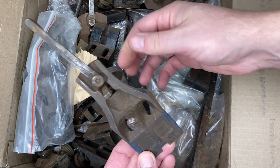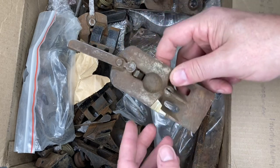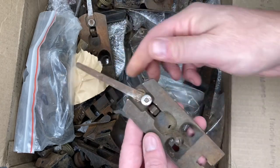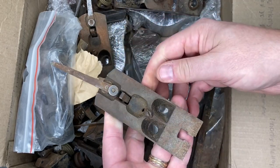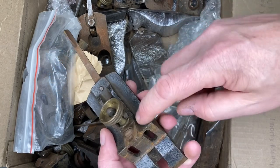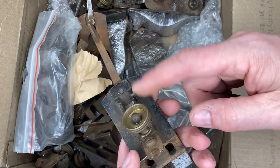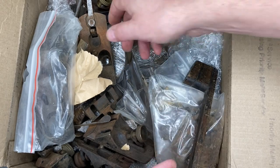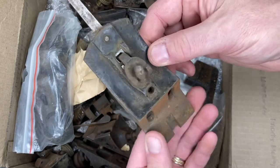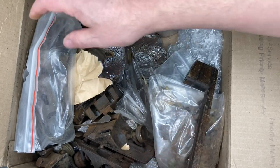There's a frog from an S4 or S5 — that's the steel plane that Stanley made — and just a random frog. A couple of these are pretty decent. That's a number three size right there, type 12 through type 15 — if you've watched my type study videos, you remember it's smooth right there. That means that brass right there can't be original to it, and you see that a lot. And that one's going to be a type 9 with no adjuster, so it's a true type 9.